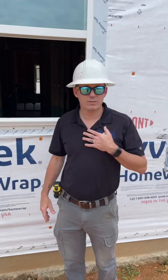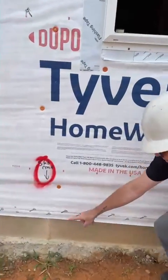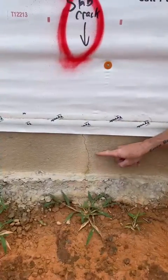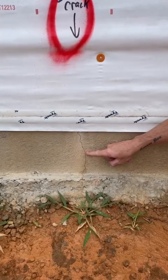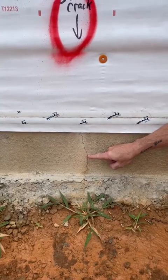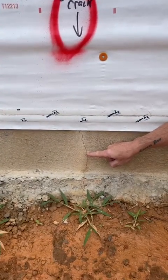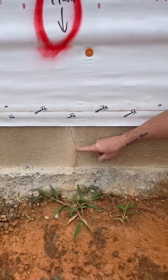Now, we're not structural engineers, but typically in experience I want to show you why they're caused. So if you'd show them here, here's a slab crack. All right, so this is pretty common to see. Looking at this crack, it just seems to be a normal settlement crack. Usually we're looking for something that's probably the thickness of like three or four pennies put together, or three or four nickels put together.